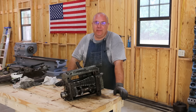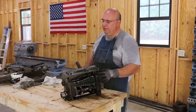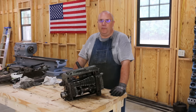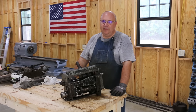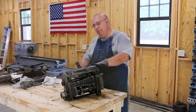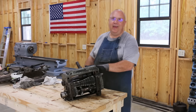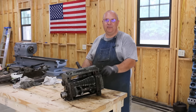So that's a quick look at how a quick change gearbox works. Before the quick change gearbox, most lathes just had change gears on the side and you would manually swap out gears to get the right feed ratios — quite labor intensive. I used to have a lathe with change gears and it might take 15–20 minutes just to pull the gears off, change them out, and get the lathe running again. The quick change gearbox greatly simplified that, turning something that used to take 10–15 minutes into just a few seconds — and it required a lot of math and engineering, all designed long before computers.